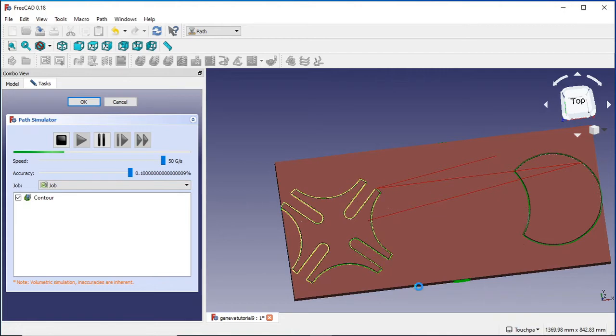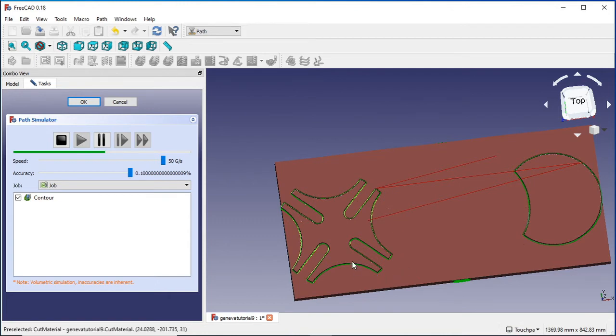We've got to remember here that when this finishes, these objects will no longer be attached to the stock. This can cause a bit of an issue - right at the end this piece of stock will be cut through and all of a sudden the piece will be loose. Unless you've glued the underside, these will just end up flying off somewhere and you'll end up either damaging yourself, your machine, or you'll have a chunk taken out of the actual item itself. We need to think about anchoring these to the underlying stock using certain types of dress-up to allow little tabs to keep these attached.